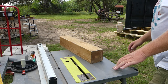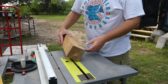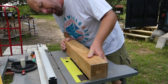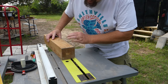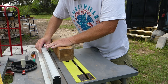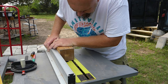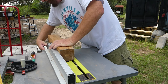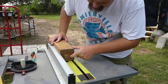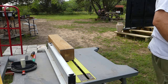I'll adjust the saw blade to match that scribe so I know how deep I'm going to make this cut, and then I can see where I made these marks. I'll put the fence where it'll ride just inside that line, make that cut and then that cut, then cut out the middle, and then we'll break out the chisel. Let me get my safety glasses.